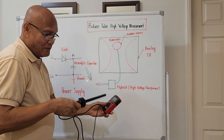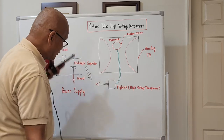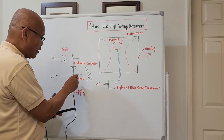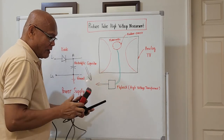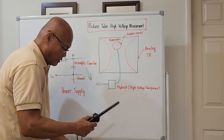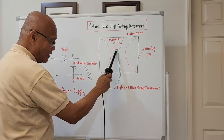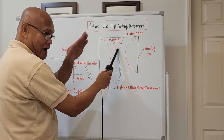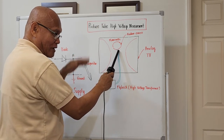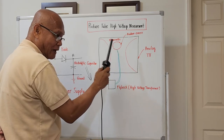This one, the meter, is on the table, so you're not holding this one, because as soon as you connect the ground over here, you're not handling it anymore. And to measure the voltage, just use one hand. Try to poke this underneath the rubber, but the other hand of yours is actually at your back, to avoid being electrocuted.